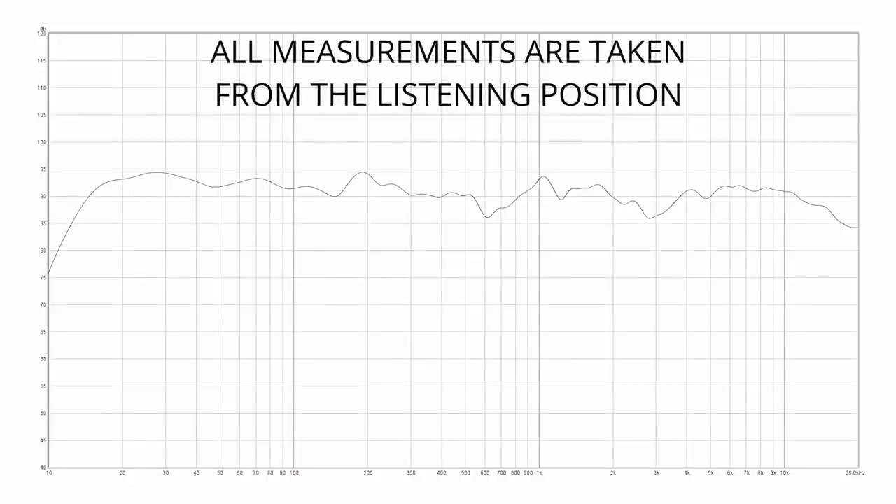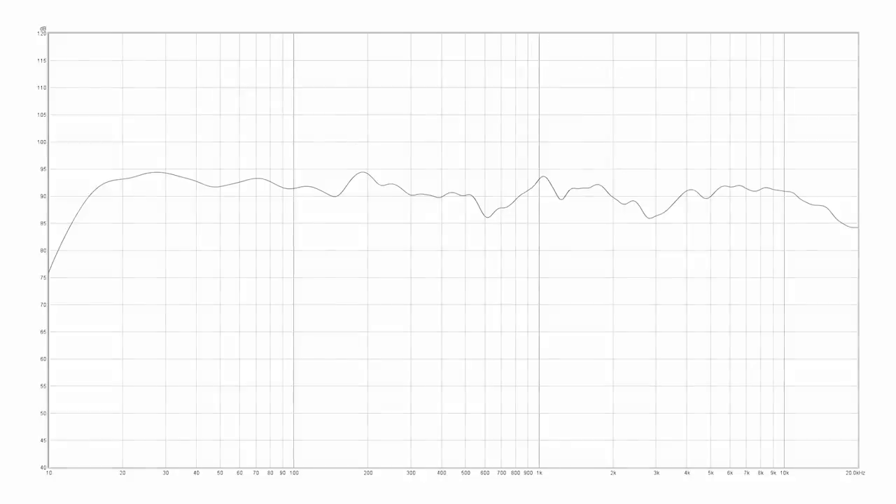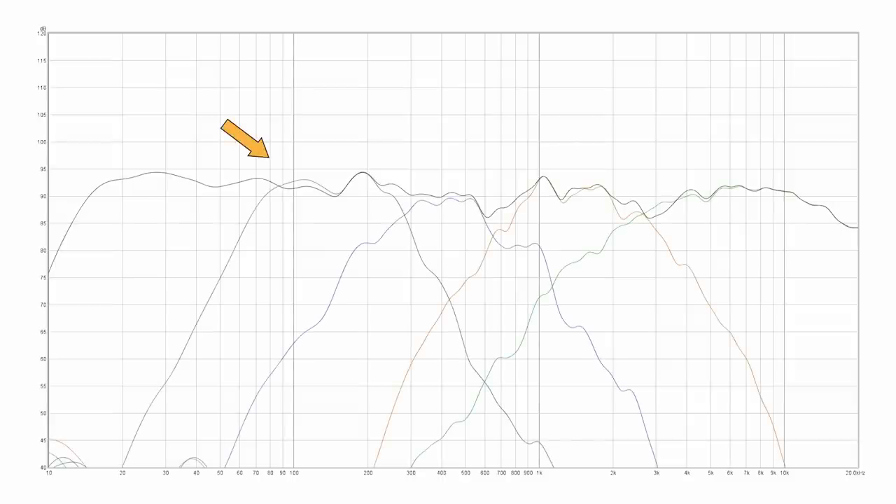This is just me playing with it for now until I build the final versions, then I'll dial everything in perfectly. What you're looking at here is the response for the left side speaker — the open baffle speaker plus the subwoofer — and I'm getting full range response right across, nice and even. There's no EQ applied to any of this. The crossover points are 80 Hz from the woofer in the open baffle to the subwoofer, 250 Hz from the midwoofer to the woofer, 750 Hz from the midwoofer to the midrange, and 3000 Hz from the midrange to the tweeter.